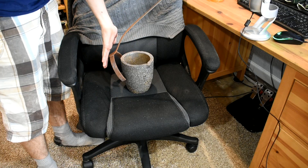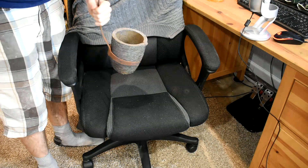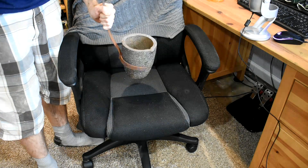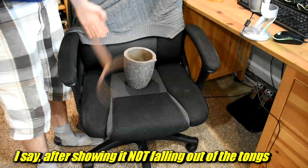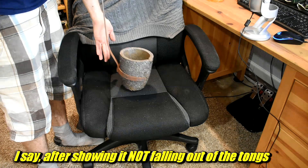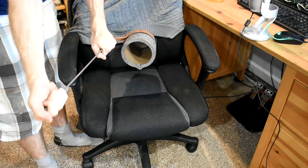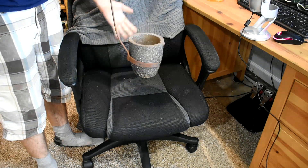As you can see, most of these needs do not apply to my old one, which is not adjustable and not super ergonomic for pouring. It kind of works for lifting and pouring because they're small crucibles, but if I tip it over the crucible is going to fall right out. I can't add a stopper because the way it works, it goes underneath the crucible around the narrower base and lifts up — so if I had anything jutting out to hold down the top, I wouldn't be able to get the jaws around it to begin with.